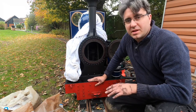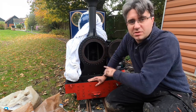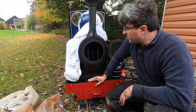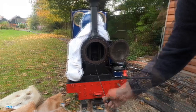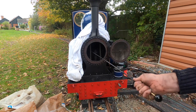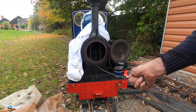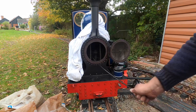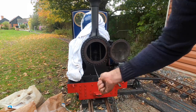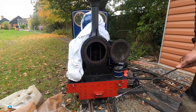I'm just doing an initial clean there to get a lot of the ash out of the way. Now we want to focus on the tubes — there's no point making the smokebox nice and clean when the tubes are still dirty, as cleaning those will just put a load of dirt back in. So it's a case of rodding out each hole, making sure it's completely free of soot. The cleaner the tubes are, the better contact the heat will have with the water inside the boiler, giving the best economic use of your fire to heat the water as quickly as possible.